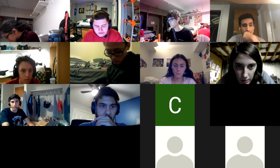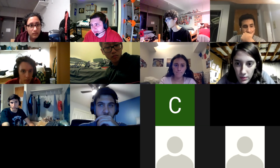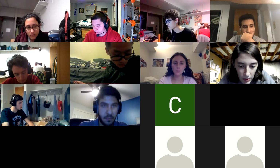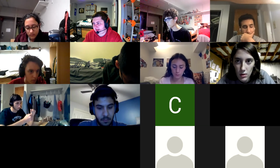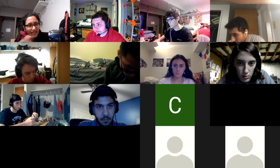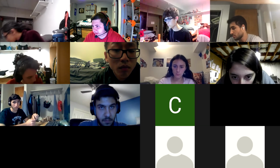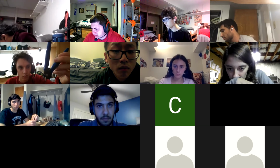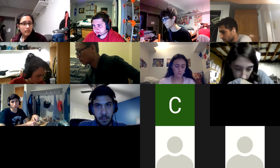Yeah, Tulasi. So you're just connecting. You can define the pins however you want in Arduino. So you just need to pick one of the analog pins, the A pins it says on the board, and one of the digital pins, which should just have numbers next to them. And then the wire, there should be a little spool of wire in your kit. Yep, like that. And then you can cut a little section off using, I think there's wire strippers in the kit. I'm not sure. So those are snips. You can probably do it with the snips, but there might also be actual wire strippers.